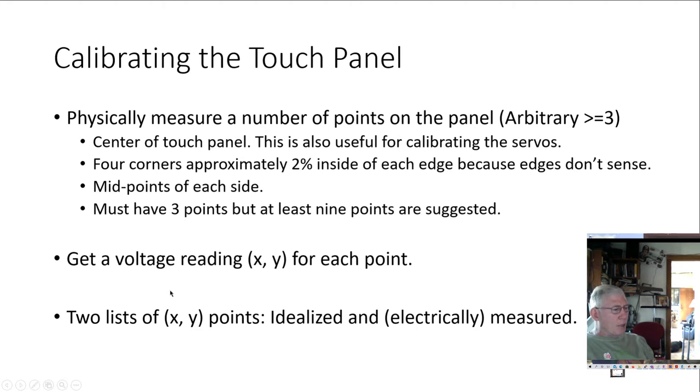All right, and we've got our reading for each point. It's really a raw voltage reading. You could actually see what the voltage was because we're applying 0 and 3.3 volts across each panel, and then we flip it and we tri-state those and then put 0 and 3.3 across the other panel. And then we sense on the panel that's tri-stated, and we drive the voltage across the panel that we're measuring. All right, so...